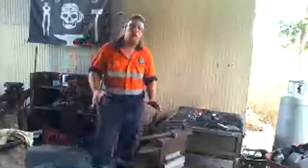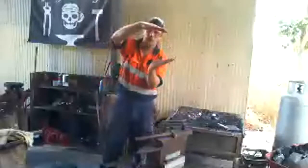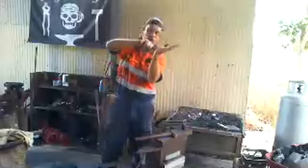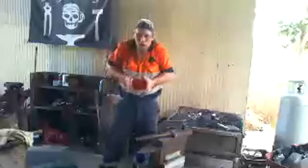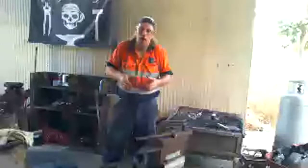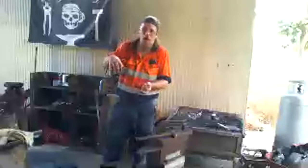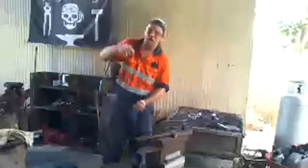Now, this is actually a modern type of blower. Originally, what they used was what's called a bellows. So a bellows is two pieces of timber. Originally, they were actually three because it had two different chambers, right? And what they would do would have a piece of leather and it was all airtight, and they would push down. Ever done it with a balloon where you blow up a balloon and you push it and all the air comes out? That's kind of what the bellows would do, except it had a metal pipe at the end so it didn't go all funny. And they'd push and squeeze the air so it's doing the same thing as what this blower is, and it would force the air by going up and down.